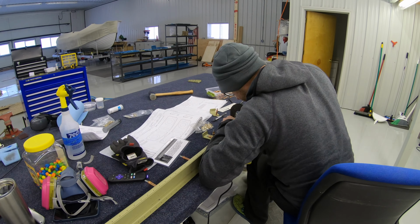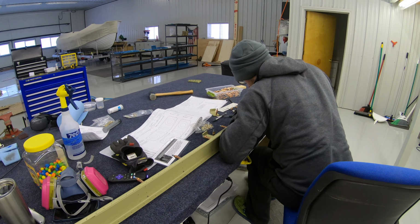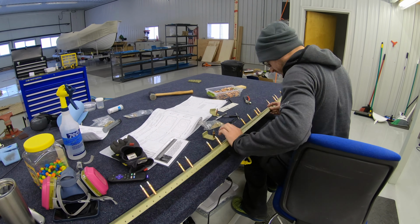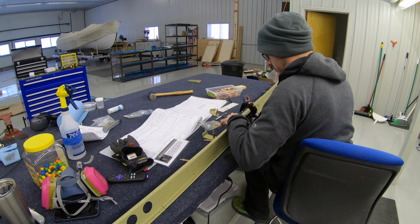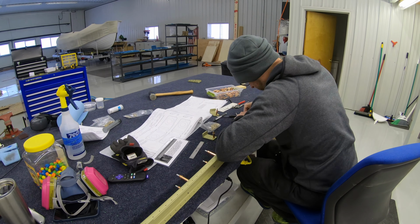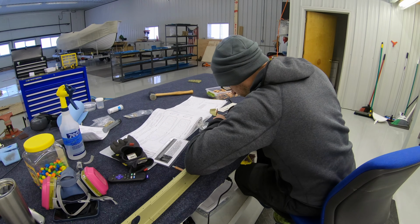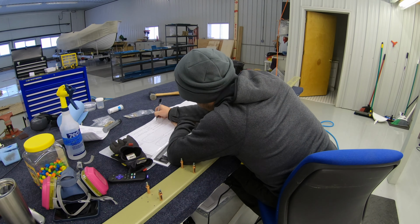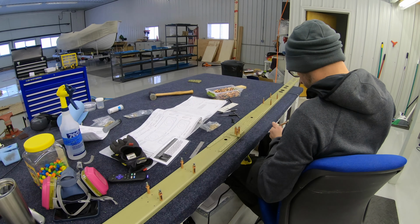and the doubler, or there's three along the very bottom that are a 4-10 rivet, where it goes through the attach bracket, the doubler, the spar, and the cap. And those are some impressive rivets.